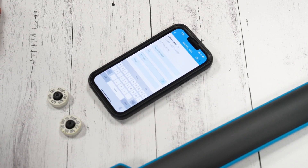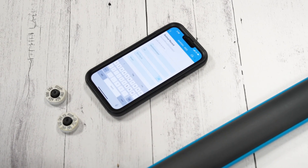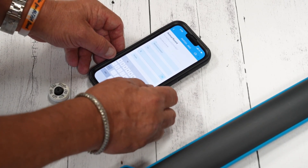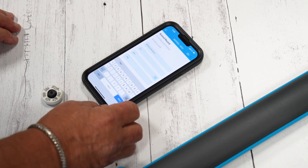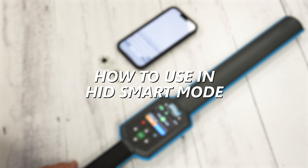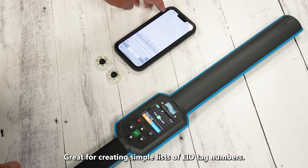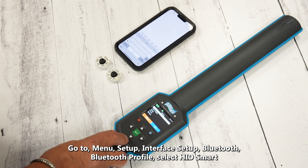We'll grab our reader, go ahead and read a tag, and you'll hear the app respond — it received our RFID. We can go to VID and manually enter a visual tag number. For TSU, enter the flag number off the side of the tube — unless you're using a barcode reader you'll enter just the flag. Let's call that the last four digits of the RFID number: 8067. Our weight from the scale head is about 790 pounds. We're done and on to the next record.